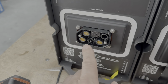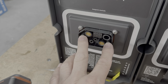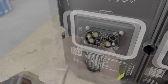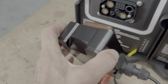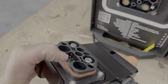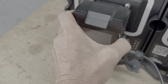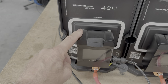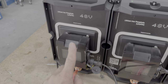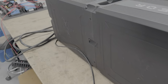The actual secret of this battery is the plug. What you'll notice in the plug are two big steel pins. In the past when I've had Amphenol connectors without these steel pins, you get some wobble and movement — that would not be good. So those big steel pins go into these two holes here and locate it, and then the data pins here go into the top, and that does not move. That plug is a US military grade plug, suitable for seven and a half kilowatts per plug. If you want to isolate that battery train, you just pull that off.